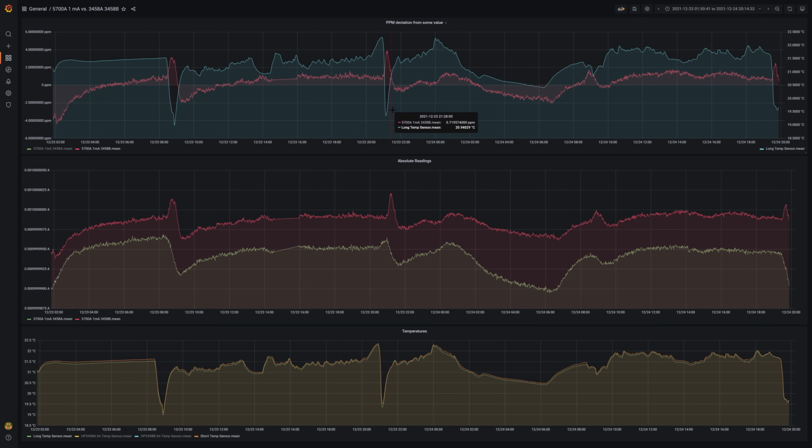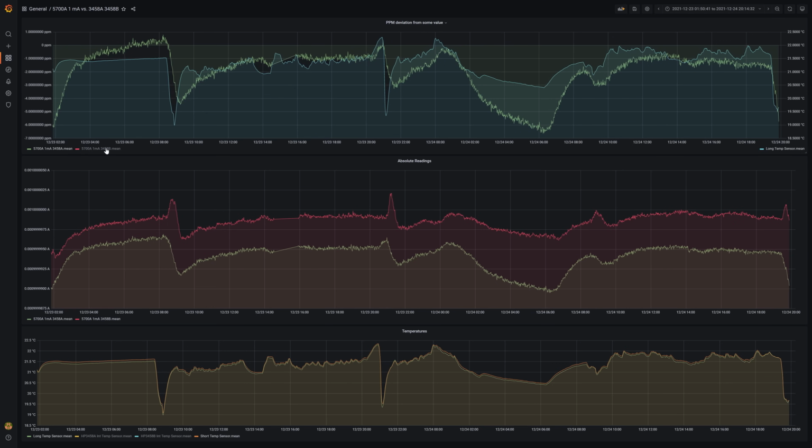It makes a bit of a strange jump as a response to sudden ambient temperature changes, but overall it's better than Hewlett-Packard, who's coming in with 4 to 5 ppm of range per Celsius worst case. Both much better than the datasheet figure, so no worries either way.